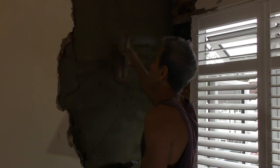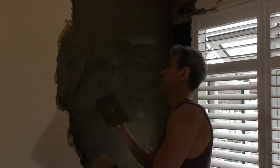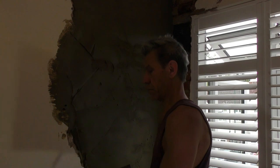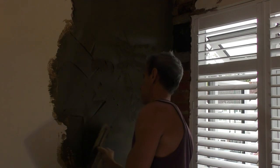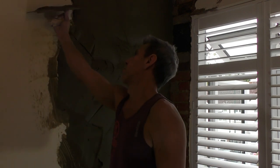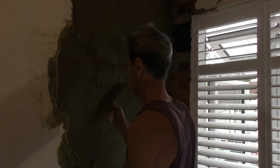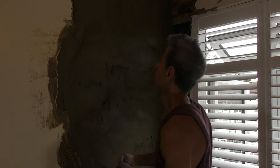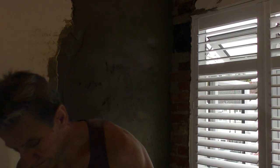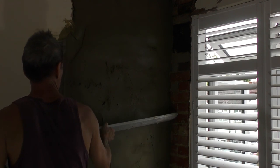If you put a scratch coat on that and let it dry, you never leave yourself enough room to put a decent top coat on it. Always remember to work the sand and cement in right up to the edge, nice and tight, so you're getting a good bond between the existing plaster that's up there and your new render coat. This is a three-to-one mix - it's quite strong but I like it like that.